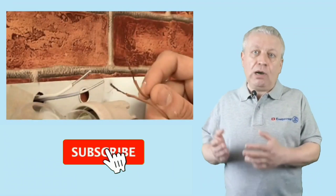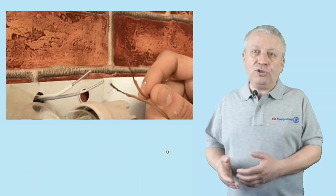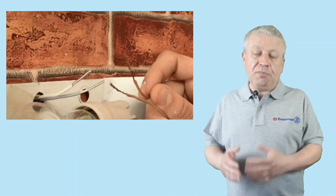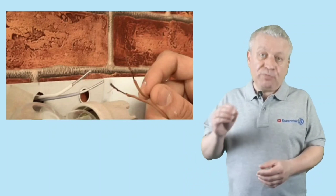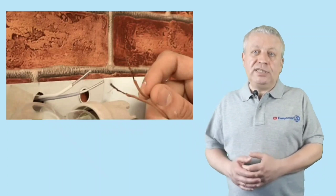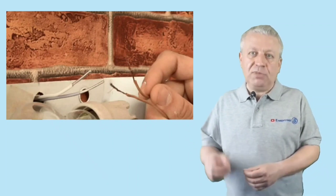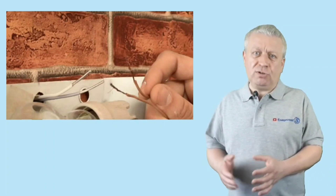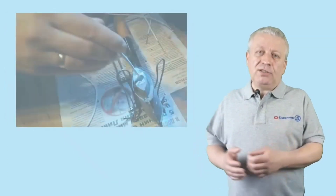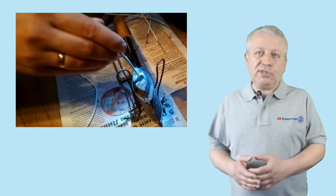Suppose you need to run one or more additional outlets from an existing aluminum outlet in a through niche. For this you take a flexible copper wire with a cross-section of 2.5 square millimeters — this will reduce the mechanical impact on the aluminum core when laying wires in the socket. Strip the ends of the copper wire, then they must be soldered. This will eliminate direct contact between copper and aluminum inside the sleeve. For soldering, it is convenient to use a homemade crucible — a slightly modified soldering iron in the shape of an axe.